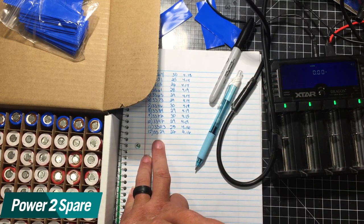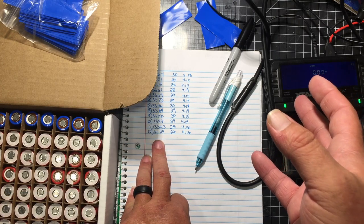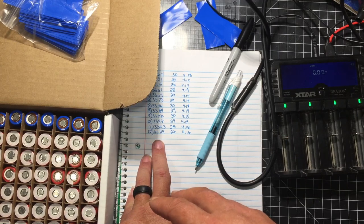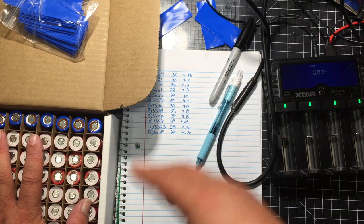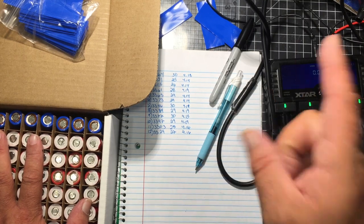Part three will be taking the batteries and arranging them for efficiency — mainly the e-bike battery build, which is going to be interesting because I'll have to tab weld every single one of them. I'm going to finish up wrapping these cells off camera, and once I'm done I'll start on part three. For the battery, I'll be using a 45A BMS and a 1.2A Active Balancer 14S. If you have any questions, please leave them in the comments. Please like, subscribe, and share. I'll check you guys out in the next video.